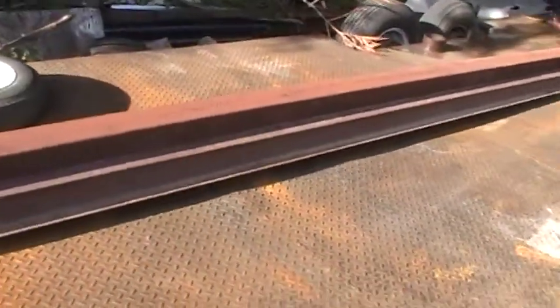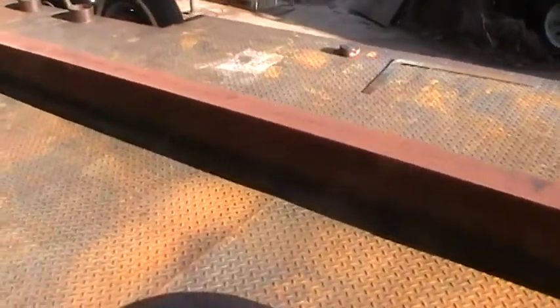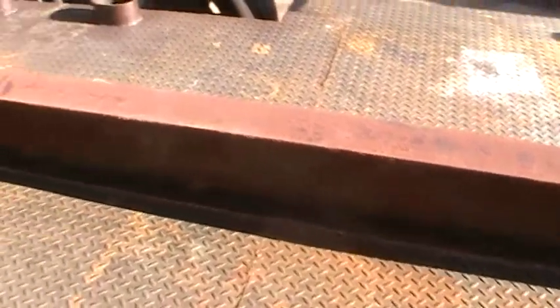The reason for that is, when you build stuff and most people do the minimum amount — I actually over-welded it. The whole top deck is welded across here. And when you weld something and you weld too much on one side, it'll pull and warp. Mr. Shrink will pull it up. So what you can see right here is pretty close to a two-inch gap under this beam in the middle of the trailer. So that's the potato chip effect.